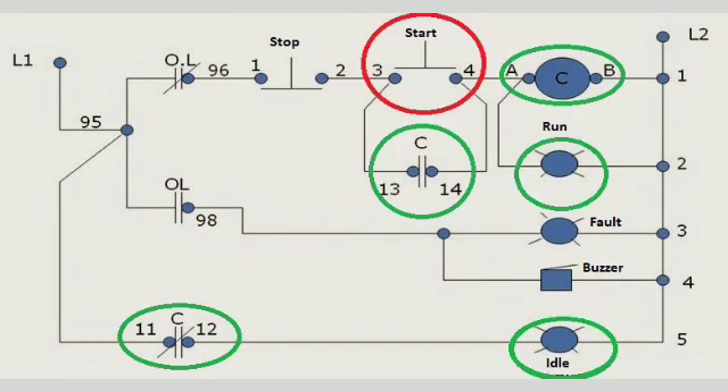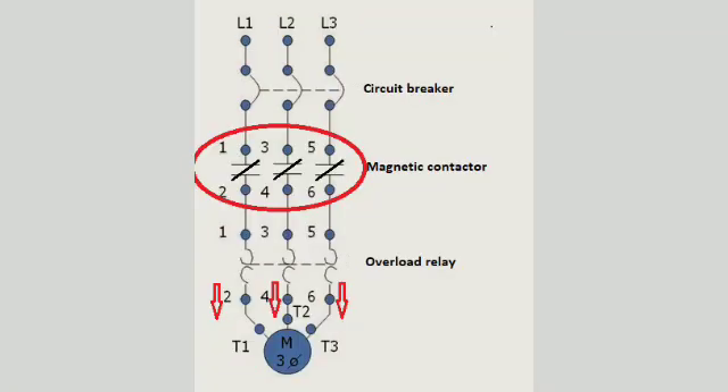To check how the power and control circuit works: first, switch on the circuit breaker — the idle or stop pilot lamp will be observed lighted. If you press the start push button, this will energize the electromagnet which will simultaneously close the normally open auxiliary contact, open the normally closed auxiliary contact, and also close the normally open main contacts of the magnetic contactor, thus causing the electric motor to run. The idle or stop lamp will then be observed not lighted. Even if the start push button is released, the electromagnet is still energized and holds the closed auxiliary contact. Upon pressing the stop push button, the electromagnet will simultaneously open again the normally open auxiliary contact, close again the normally closed auxiliary contact, and also open again the normally open main contacts of the magnetic contactor, which will stop the electric motor.